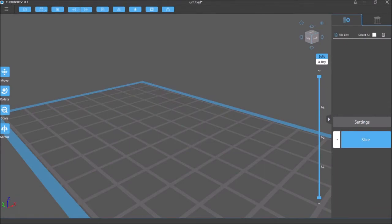Now, I had already exported the object into an STL file, so I'm going to load it back up in here. There we go. There's the object, the way it sees it. Now this print area is about 5 by 3 inches, plus or minus, so this looks like it's about the right size. Remember what I said, even though I was using meters in Blender, it actually converts to millimeters in these kinds of programs. So that's the item itself.